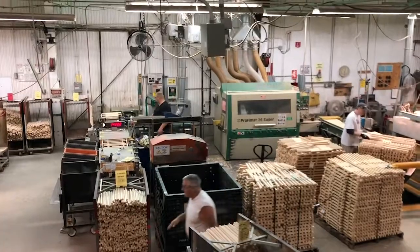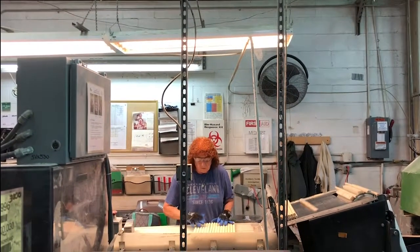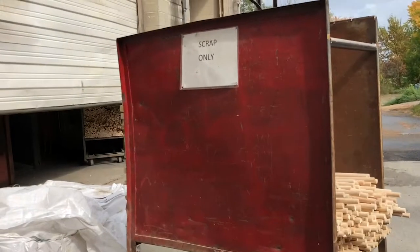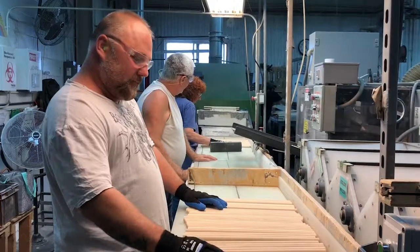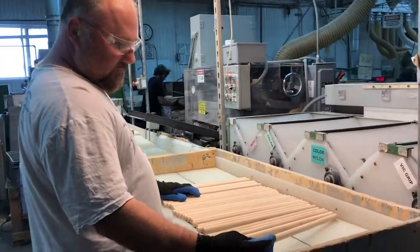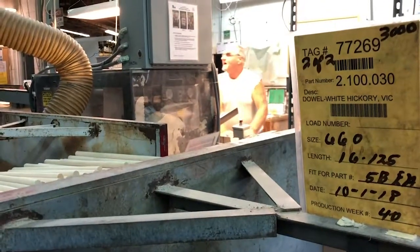The first step is to produce a straight dowel. We then start sorting for quality — we inspect for straightness and for weight. Very crooked wood winds up in the boiler. Very straight wood can now be made into a drumstick. If it wiggles less than a 32nd of an inch, it's okay to go right to the sticks. It then goes through a grading inspection process, which is probably the most critical process that we have. The sticks are then trimmed for length for the particular style.